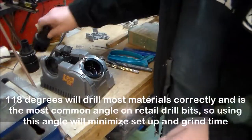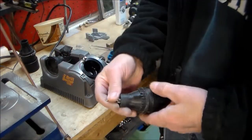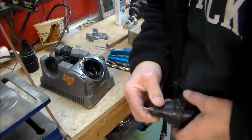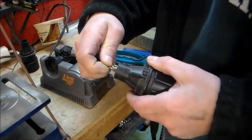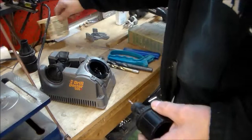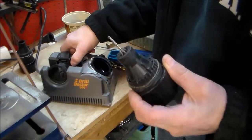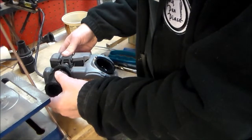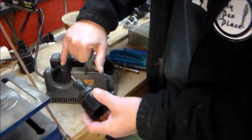The process is simple. Take the collet, the drill goes in, and you adjust the collet down. In this case for a small drill, leave it a little loose so you can turn the drill by hand. The tool can do 118-degree and 135-degree drills. I leave everything at 118 degrees. You'll find lots of details on my web blog. The first step: this little block goes in right along with the 118-degree marker.